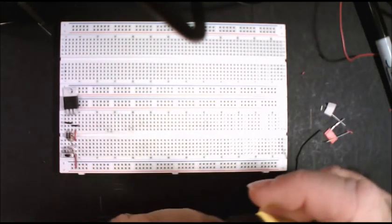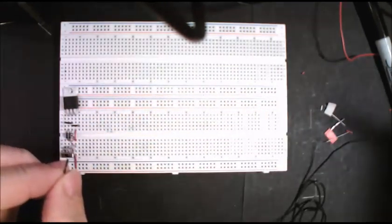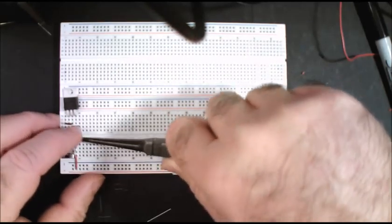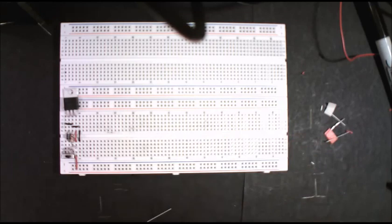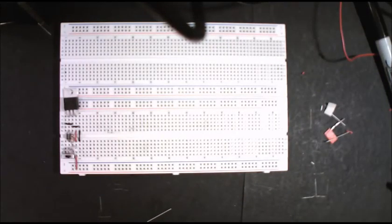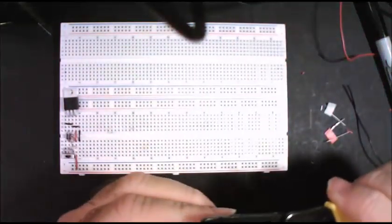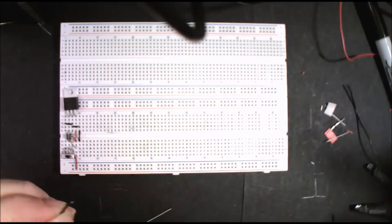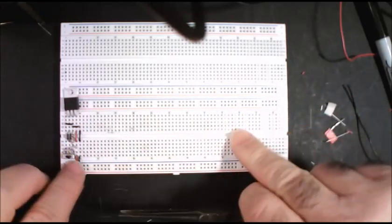We're going to go from 5F to 5E — that is an 8-hole jumper. And from 5A to the minus bus, power bus 1 minus, 2, 5A — and that is a number 8. Now let me hook up power. You're going to hook power up using your clip. This is going to be the plus and this is the minus. Now we're going to plug this in.